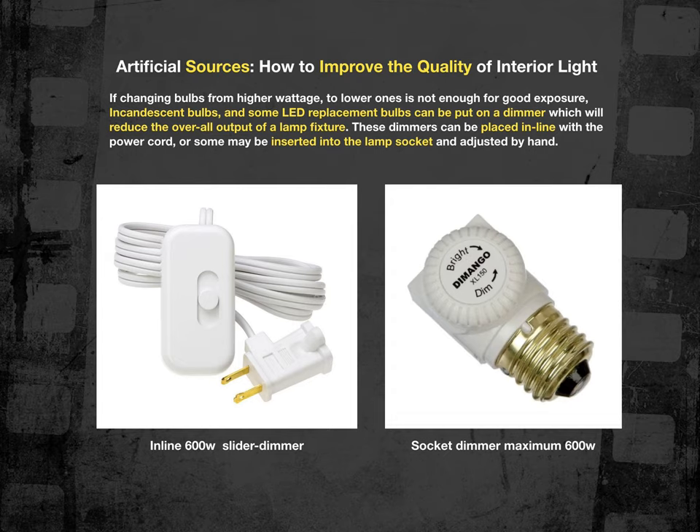In terms of control of those household fixtures, there are a couple of ways to dim — either with a slider inline with the power cord or with a socket dimmer. Both are convenient ways to control the intensity of incandescent bulb output. Bear in mind that with incandescent bulbs and resistance dimmers, they will change color tone and become progressively oranger and deeper amber as you dim them further. So sometimes it's more advantageous to physically change wattage than to dim, because you suffer a severe color shift. However, some newer dimmable LED replacement bulbs can be dimmed — they're more expensive as dimmable models but you can use these methods with them.